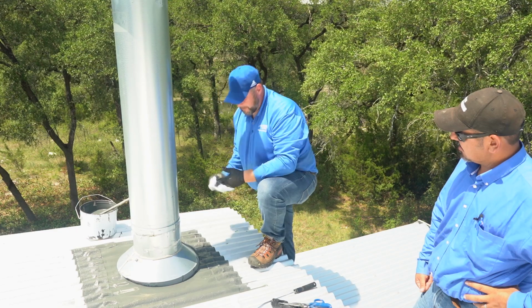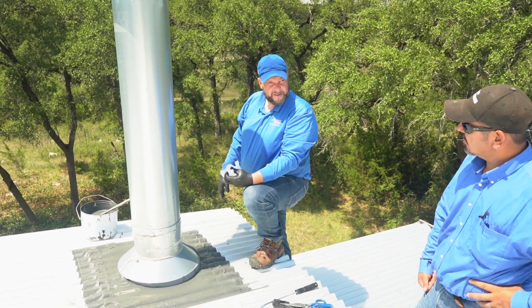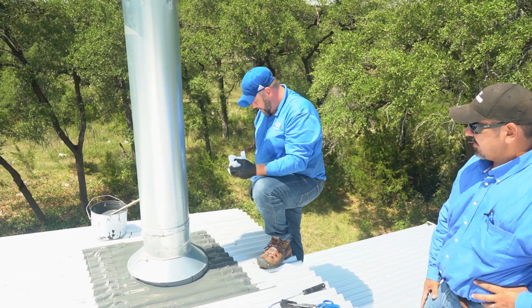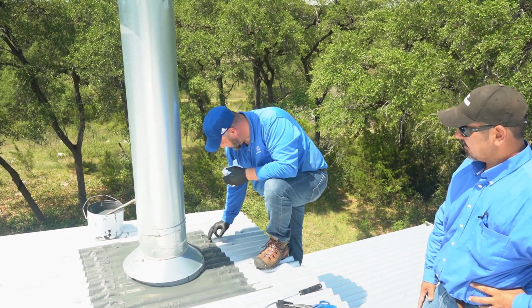Paint your fleece on your walls, and you just hang it and come right up. Lay it right over it. So you paint it first? Paint it first, lay your fleece in, and then paint it again. Okay, and it'll just stay? Yep. How big of a gap can you bridge over? 1/8 of an inch.